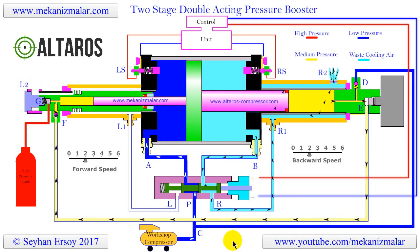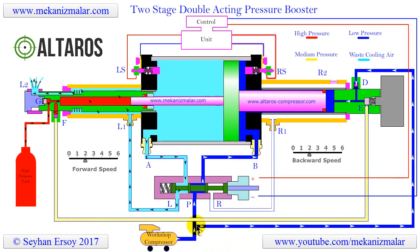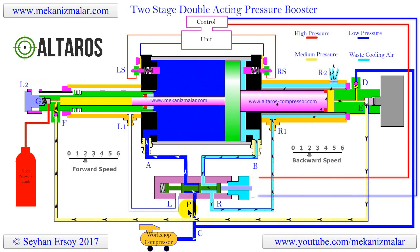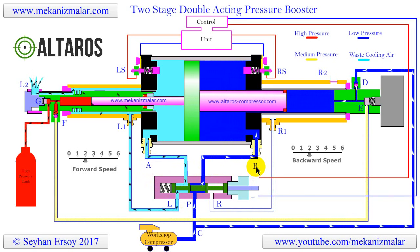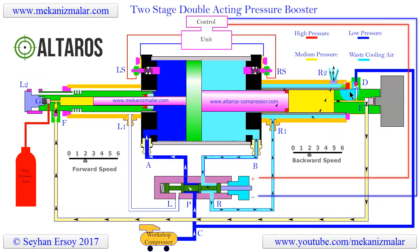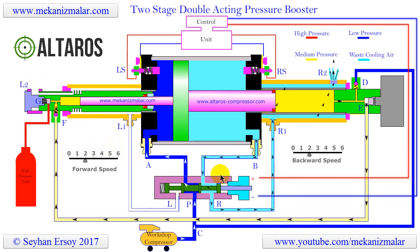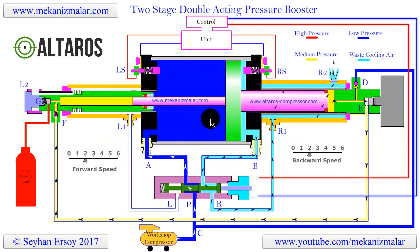The reciprocation circuit. The compressed air coming from the workshop compressor is connected to the P port of the control valve, and it is called inlet pressure. This compressed air is diverted to A and B ports of the large pneumatic cylinder, which can handle pressures between 5 to 10 bar, or 75 to 145 psi. The control unit sends the appropriate signals to the solenoid of the flow valve, which controls the direction of the inlet pressure to A or B ports of the air cylinder.